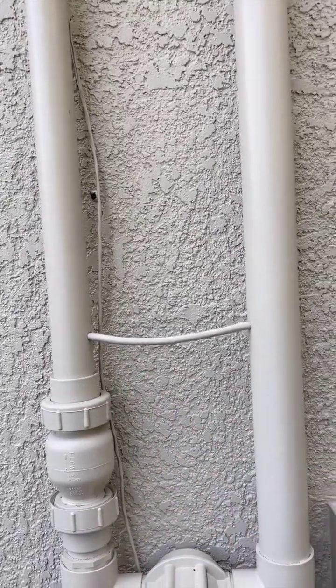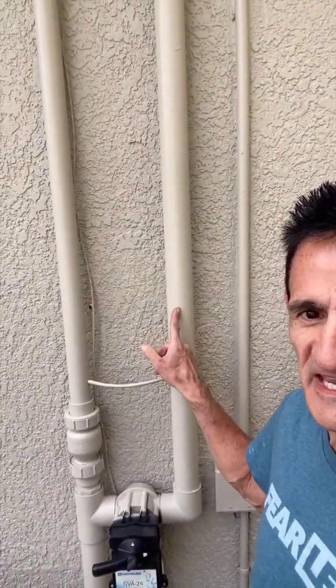Why? So let me show you real quick how a solar pool panel works. Here's an example of one type — these are individual tubes and water flows through these tubes. So if you have a larger feed and a smaller return, what's going to happen is it's going to put a lot of pressure on these tubes, and that's going to cause leaks and shorten the solar panel life.